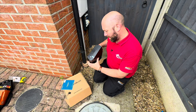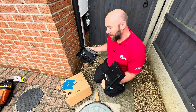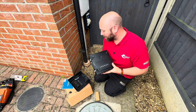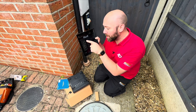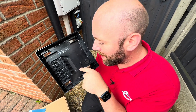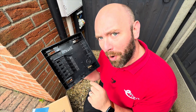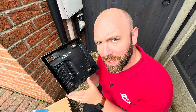After figuring out the opening mechanism — look at that — we've got a separate back plate, and we have these pins sticking out of the back that plug into here. Our cables are going to be going into here. What is interesting is that this has an L1, L2, and an L3 termination. I thought this was a single-phase EV charger, but we have terminations here for three phase.